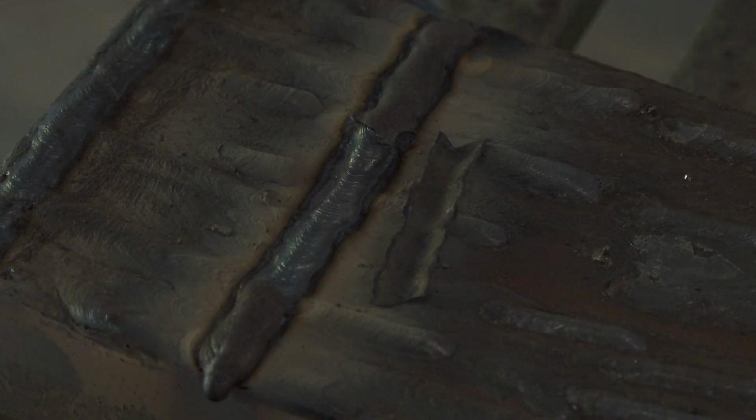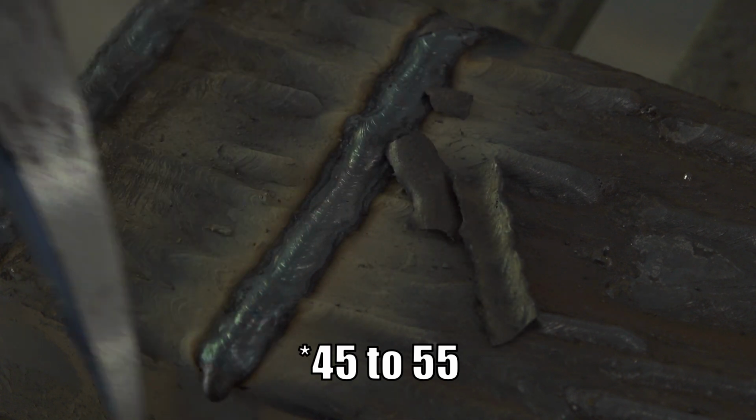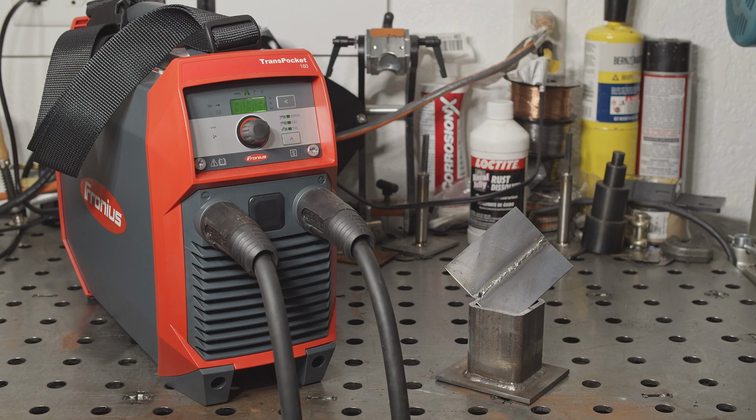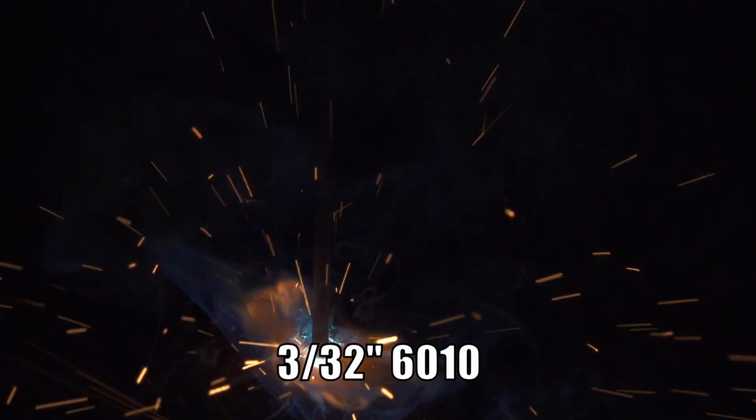6010 did run great. And remember the arc break voltage I mentioned, that setting? I did turn that setting from 40 to 55 on the 6010 mode because I had the arc turn off once or twice when long arcing 6010. It only happened when I was probably running a bit too high in amperage and the rod was burning really quick. I don't normally really run 6010, so I'm not very good with it either. But once I turned that setting up to 55, it never happened again.